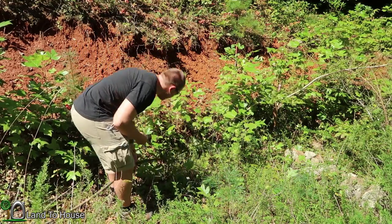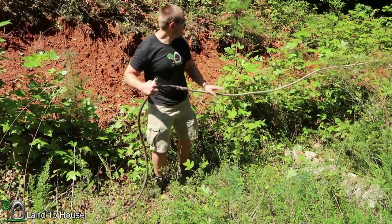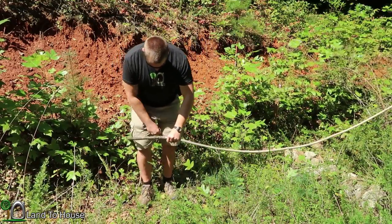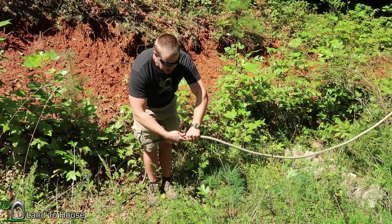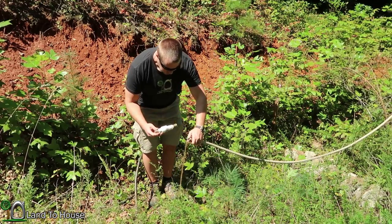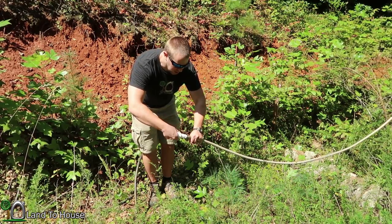The first test is going to be here at the 100-foot mark. I'm just going to separate this, install the valve, and go measure again and see what happens. I'm kind of predicting that the pump is going to stop when I relieve all this pressure here — and yeah, it killed the pump.